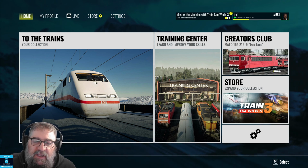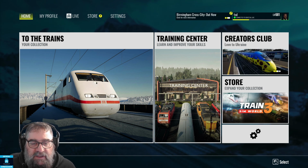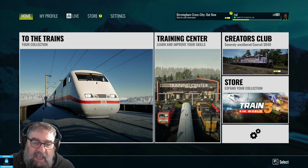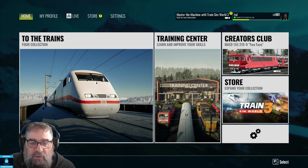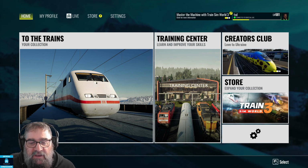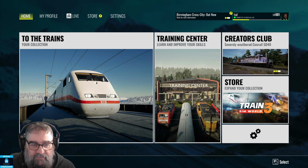Let's just talk about braking in general and get it back to simple. Braking is used to slow or stop the train or maintain a given speed on a downhill gradient. The train brake acts on the entire train and applies braking force on usually every wheel of every connected vehicle. Again, let's keep going with the keep it simple version, and we'll pretend that the same force is applied at every wheel at the same time throughout the train.